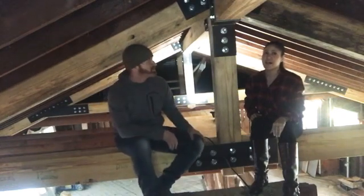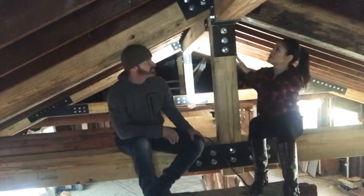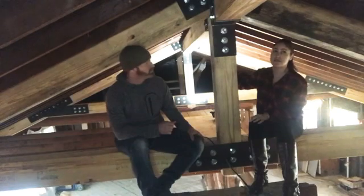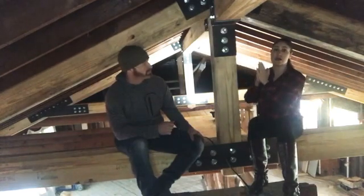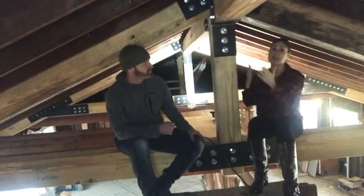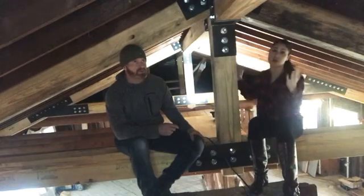And then he had to put in each piece of the ridge beam. We worked with Theodora, she was our architect on this. The reason we did it this way was because then each piece can have its own ridge beam, versus one ridge beam the whole length, which would honestly have been double its size had it had to carry all the way across.